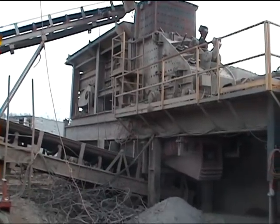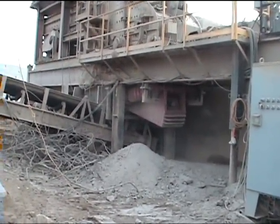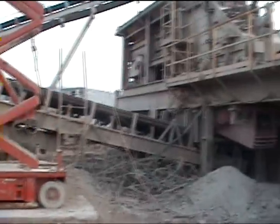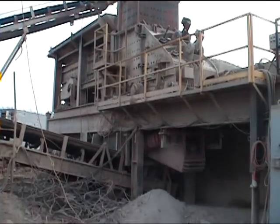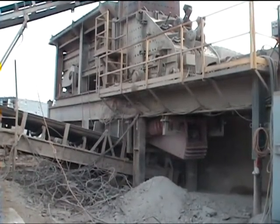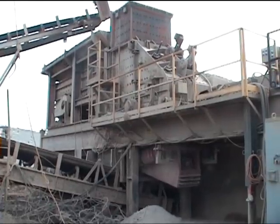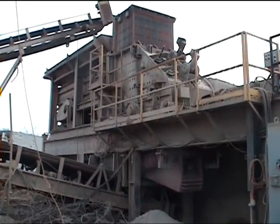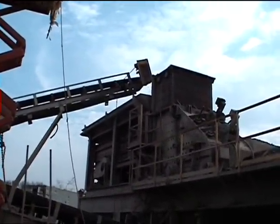This is another view of the plant which shows the electromagnetic feeder underneath where the material is transferred before it goes up the belt. That helps to transition the rebar onto the belt without the rebar actually contacting the bare belt itself, where a problem could of course occur. And that's the rebar coming back into the feeder itself.